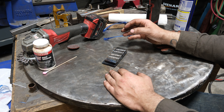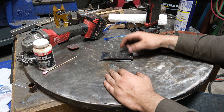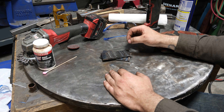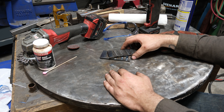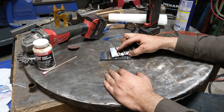I got the test specimens cut and etched, so let's take a look at them. Here are the two beads — the one on the right is run DCEP, the one on the left DCEN. We're quite a bit zoomed in here, so it looks rougher than it actually does in person. The DCEN weld is slightly narrower overall and the weld pool didn't seem to wet out as well.